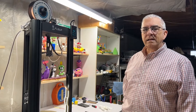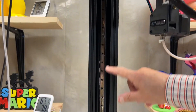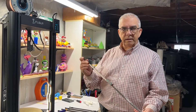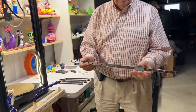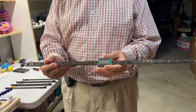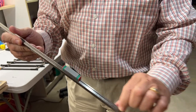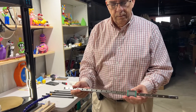The next thing we're going to do is grease the ball bearings in the linear rails. The linear rails are those steel sections inside the legs — there's one in each one. This is a linear rail: this is the rail, this is the slider, and this is what makes the arm go up and down. Inside this thing there are about 32 ball bearings, very tiny. On each side you can see there's a groove — that's where the ball bearings ride, and that's where we have to get it all greased up.